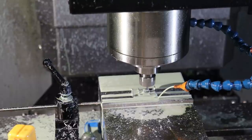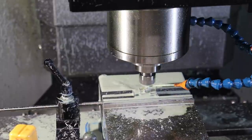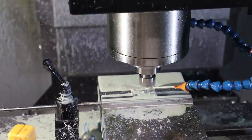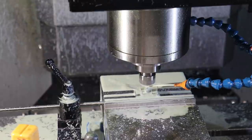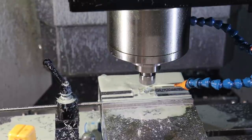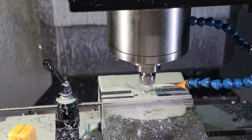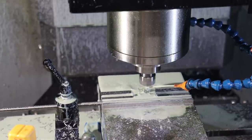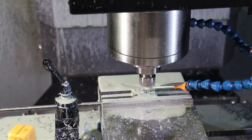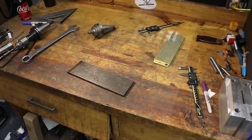Yeah, I set the coolant automatic so that at the end of the night, probably 3 in the morning or something, when the spindle cool down sequence starts, it'll turn off the coolant. Because when you let the spindle run high RPM for a long time, it's best to have a cool down sequence so that your bearings don't get jammed up by turning off hot and then cooling down and clenching up on the bearing. So it's like a 20 minute or a 10 minute slow down process that I program into the end of the program. And that's it. So about 4 or 5 hours later, it'll be done.